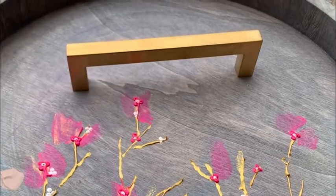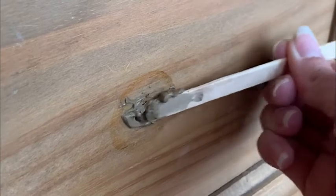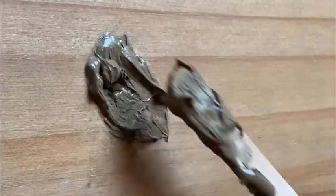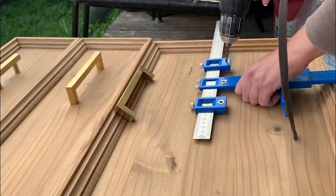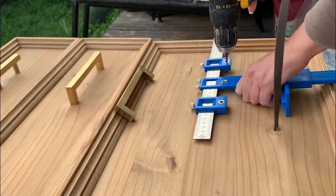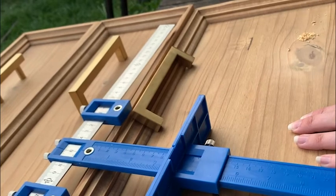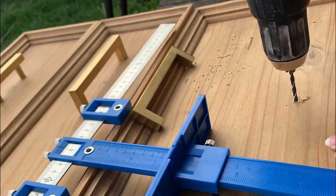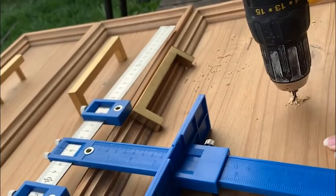It was fine that the piece came without handles, as I had some gold ones that I wanted to use on it anyway. I filled the existing holes with Dixie Belle's mud filler, and needed three coats to get a smooth finish. I used my punch hole locator to work out where the new holes would go — as long as you measure the handles correctly, you can line it up with the middle and drill straight through the guide itself. I did this before I painted, so I didn't risk scratching the paintwork before it was fully cured, which takes about 30 days. Also, if I did make a mistake on where the holes were located, it's better to fix it before I've primed, painted and sealed.